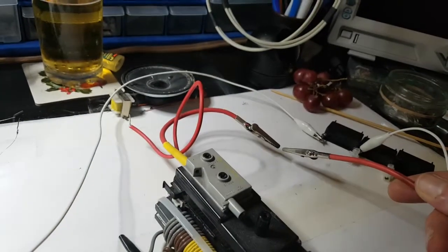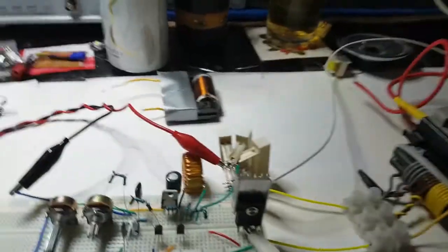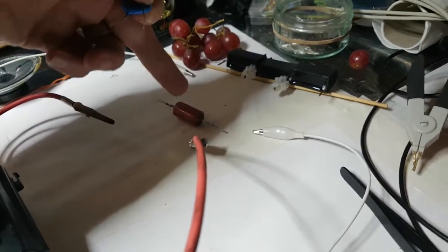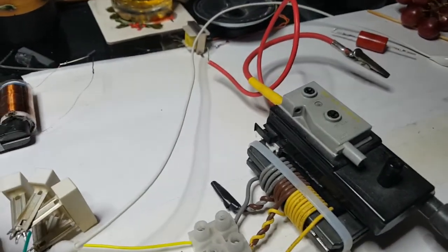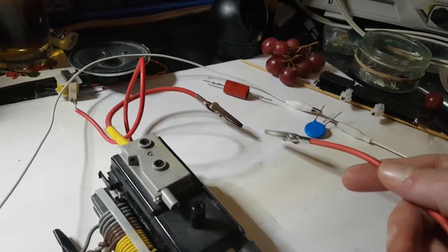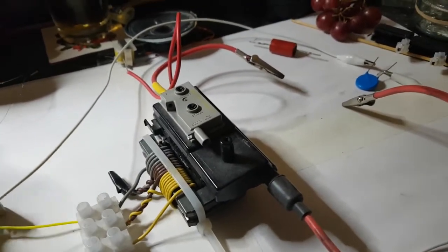Oh that's tiny. Look how it knocks out that arc as well — that's noteworthy. I'm going to try one of these because this one's a lot less — this is 100 picofarads, this is 100 nanofarads single 3 kilovolt. Let's just go there and see what happens. Connected like that — that's just how the other one was connected, nothing special. Wow, it's making a bit of noise. It's jumping, starting itself off across a big gap which is good, and making quite a bit of noise — just with that little capacitor.